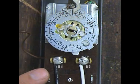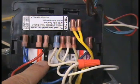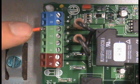Start by removing the power from the Aquastat. Disconnect the wire coming from B1 on the L1 of the primary control, burner relay, or HOT of the gas valve, and attach it to terminal number 1 on the UC-1.